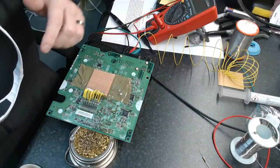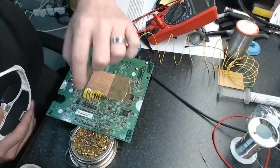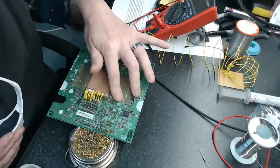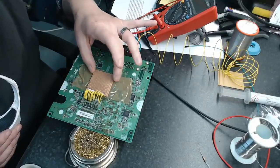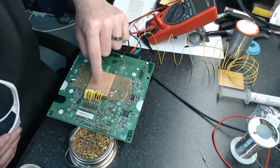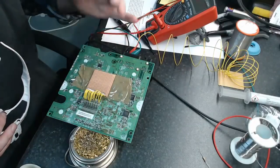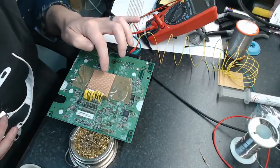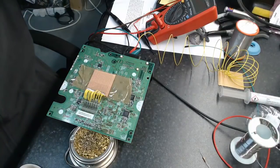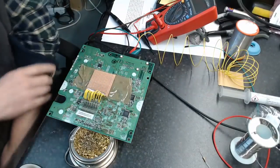So now for the next most boring point, got to connect our little yellow tails onto these pads here. Then we've got a pretty secure space to work on where I can solder tails on here, or we can even probe directly onto this. We could probably do that for tonight just to test it out. Just probe on there with a 1K resistor coming from the 5-volt line, and we should be able to drive the thing. So yeah, let's give that a shot. Once more unto the breach. So here we go. All right.